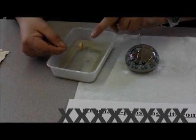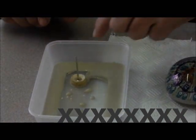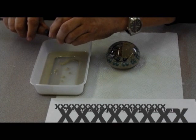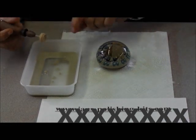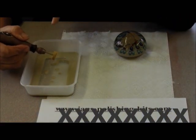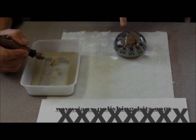Once you've given it a good soak, plenty of water — because it's four layers, you've got lots of grit trapped between the layers and that helps with the process. It will take longer to do it just with the coarse powder than it will with the wet and dry followed by the coarse, but this is just to demonstrate that you can. A lot of people are frightened to use the wet and dry because it makes it look a lot worse before it gets better, but it will get better. I always run the Dremel as slow as possible — on 5,000 revs. Some machines only go down to 8,000 but that's fine. The slower you do it the better, because it keeps the granules in place and doesn't throw them off.